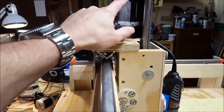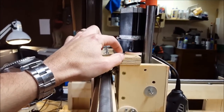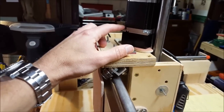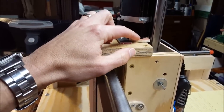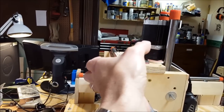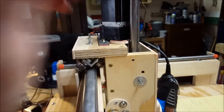For the Z motor, I wanted to be able to angle the whole thing back a little bit. So this is a threaded piece of aluminum, and the bolt right here fits into a tapped hole and pulls nice and tight. This sits a little bit lower so the whole thing can be angled back slightly — it was leaning a little too forward and bumping into these rods.